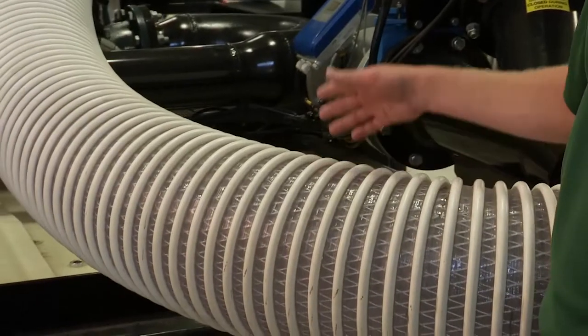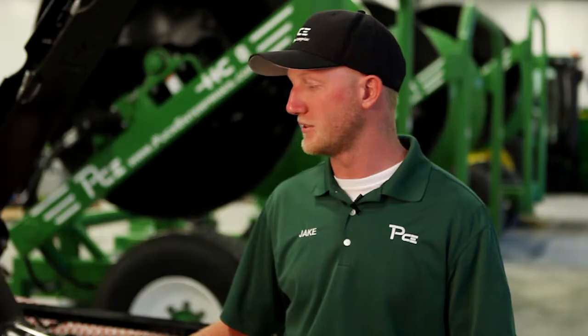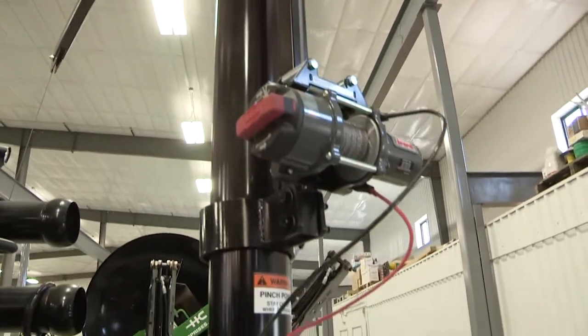Now we're at the back of the lead pump. We have our suction hose. Puck Custom Enterprises makes their own vacuum systems for these Cornell pumps to prime them. We use a 10-inch suction hose on the back of this pump. We also built our own booms because these hoses are pretty hard to handle by yourself. It's an electric winch operated with a remote control in your hand, so you can put these into the pits or lagoons by yourself if needed.